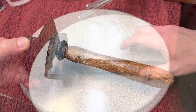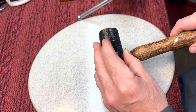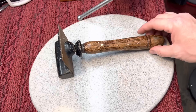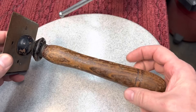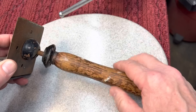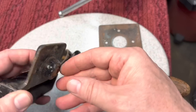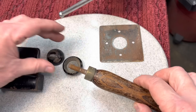Let me show you how this works and the beauty of it. This particular scraper has a big heavy cast metal top up here, and it loosens that squeaking. You can adjust it all different ways for drag scraping. I'm going to go through how important it is to get the angle correct on the surface you're working on in a little while. But first, let's get this into usable shape. All it is — it's a handle with a threaded piece, here's your blade, and inside here you have a little ball nut. That's a threaded ball, and there's a captive hole where that goes. Very few pieces to it. There's your handle.